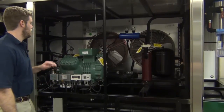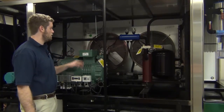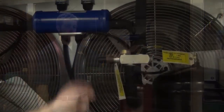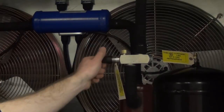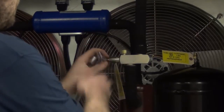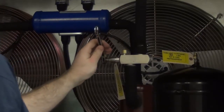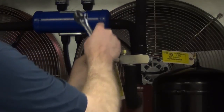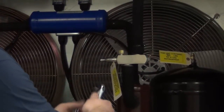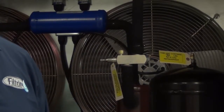To begin the initial startup of the refrigeration system, you're going to have to open up all of the refrigeration service valves labeled with yellow tags. There are two — one on either side of the compressor — and then three more: one on either side of the receiver and one additional valve that need to be opened. To open one of these refrigeration valves, remove the cap, slightly loosen the packing, and back out the valve stem all the way until it's completely back-seated. For a valve hooked up to gauges, after it's back-seated, turn it back in about a quarter turn to allow gas and pressure to go to the gauges. After that, tighten down the packing to avoid any leaks, and repeat this process with all of the refrigeration valves in the circuit.